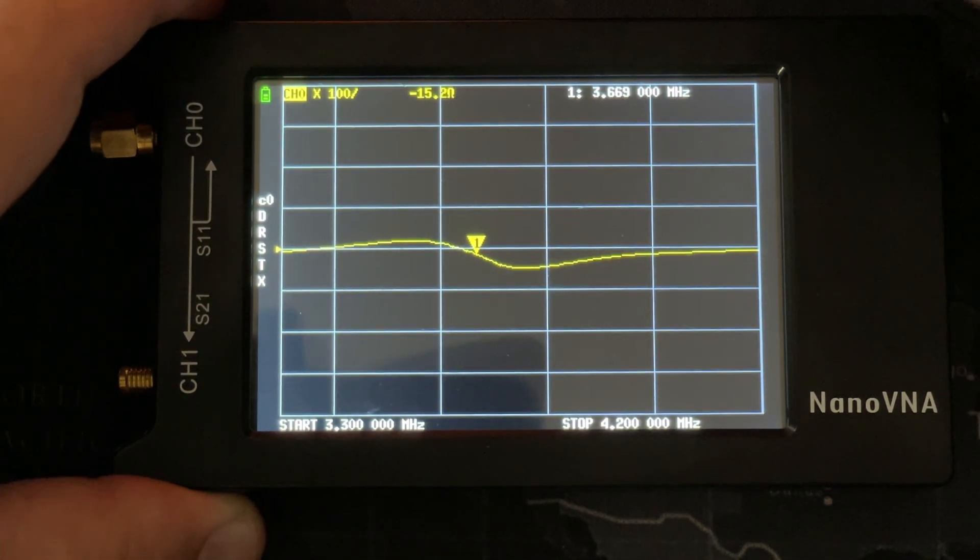I can't believe I waited this long to start playing with one. After about a week of use, I'm pretty darn impressed. I've compared this with antenna analyzers that cost five or six times the price, and this is just as accurate. The only downfall is that you have to calibrate it every time you change something, which isn't required with, say, a RigExpert Stick Pro or an MFJ-269 — those just do it without needing to fuss around. But for $75, you really can't go wrong. You can take this portable, use it as a portable HF, VHF, or UHF antenna analyzer — it covers 50 kHz to 1.5 GHz, which covers everything in the amateur bands.